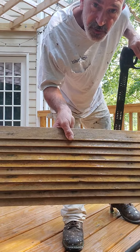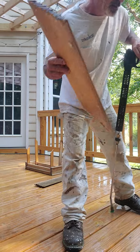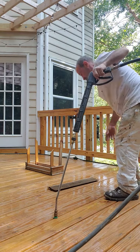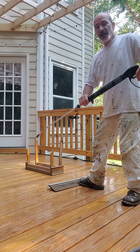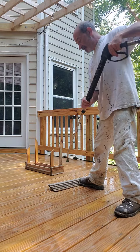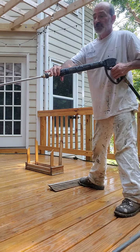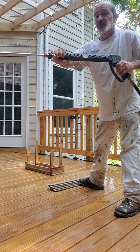You want to try to remove the gray from the wood to clean it up. Now it just needs to dry out real good and then it should be ready to stain. When you wash, you want to make sure you get the wand moving before you start. If you start directly on the piece of wood, it's going to drill a hole in it or make a mark on it. So start off pointing the wand out, then come at it and feather it in.